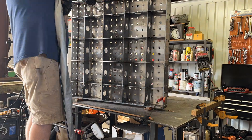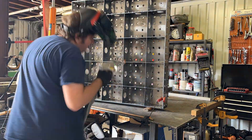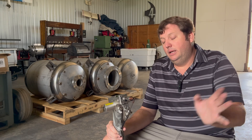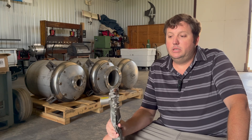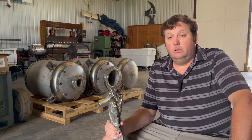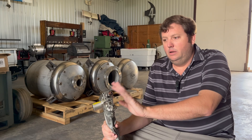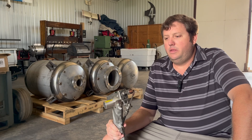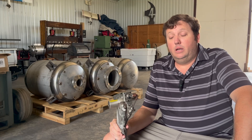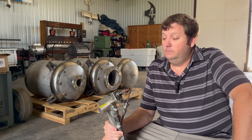The safety concern with this is the laser light. It comes with a safety feature where it's supposed to have the tip touching the metal before it turns on, and I highly recommend using that as long as you can. But you can get around that, and when you do you're putting a high-energy beam out there — if you're not paying attention, your work boot can have a burn mark from three feet away. Treat it like a gun: pull the trigger and it shoots a high-energy beam that can do a lot of damage within five feet or farther.